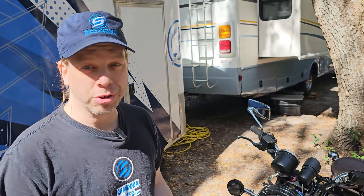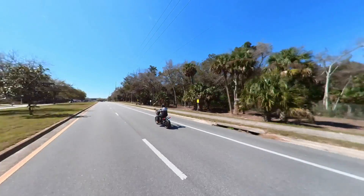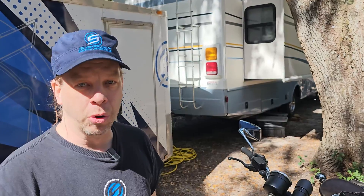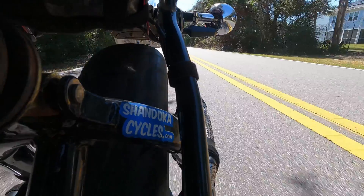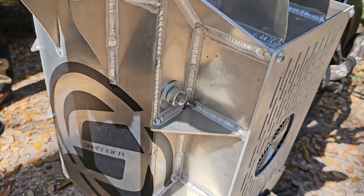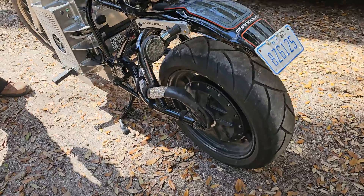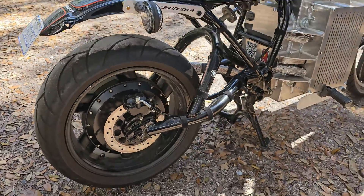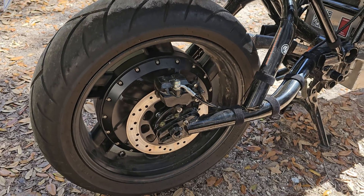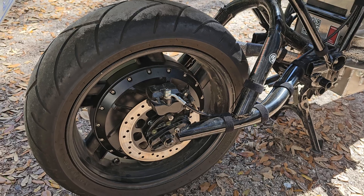It maintains the structural integrity of the bike, but gives you plenty of freedom for where to put components and how much battery space you've got. We use a hub motor to really maximize how much space is available for the power systems. It's rated at 15 kilowatt continuous and peaks around 26,000 watts — equivalent to about 32 to 35 horsepower.